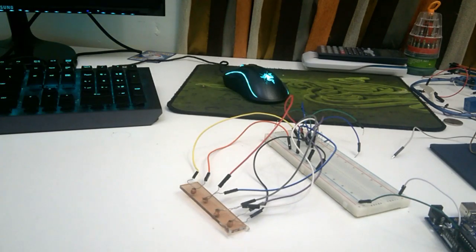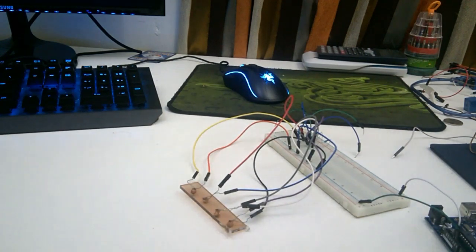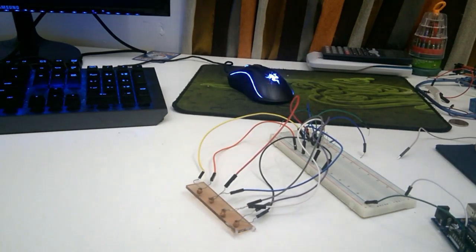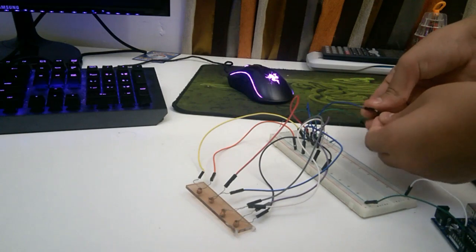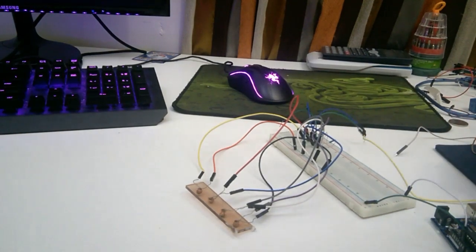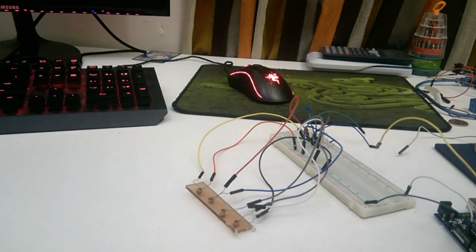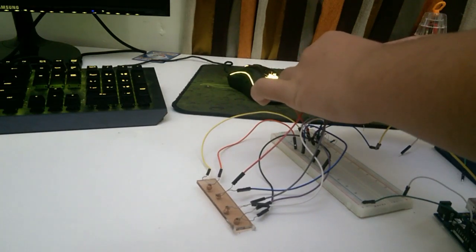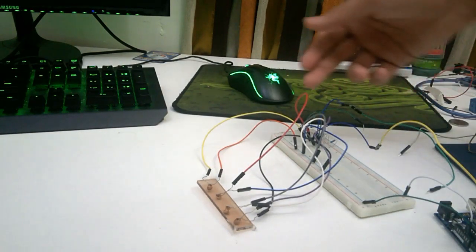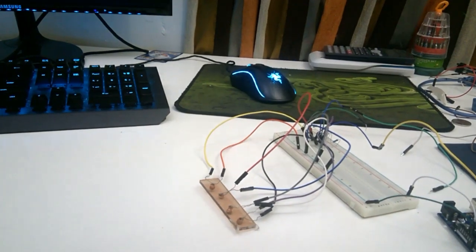Now we're going to set up our LDRs, and you can pause the video whenever you want and take a slight glance at it. So basically we're going to start off by connecting these with an extender wire, which is a male to female, and we're going to connect it to a 1, and then another one, and connect it to the other one. So basically we just keep repeating it with the 4 wires for each photoresistor. By the end it should be looking like this.